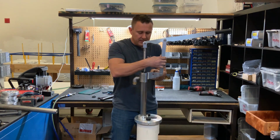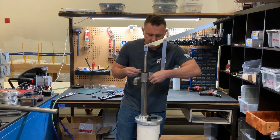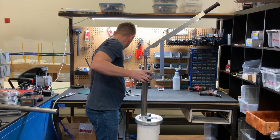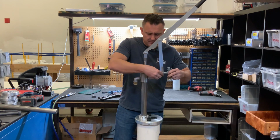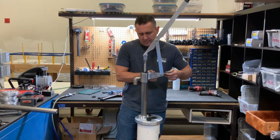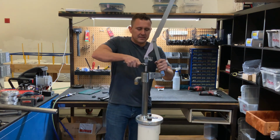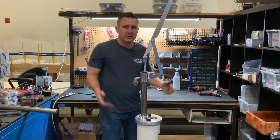May need to wiggle the handle a little bit just to get it to go. But you'll want to get all 4 of your bolts in. Make sure they're nice and tight. And then I always like to tighten once everything's connected. Tighten that pump rod one more time because you can get a good torque on it. And now your rod gland seals are changed.